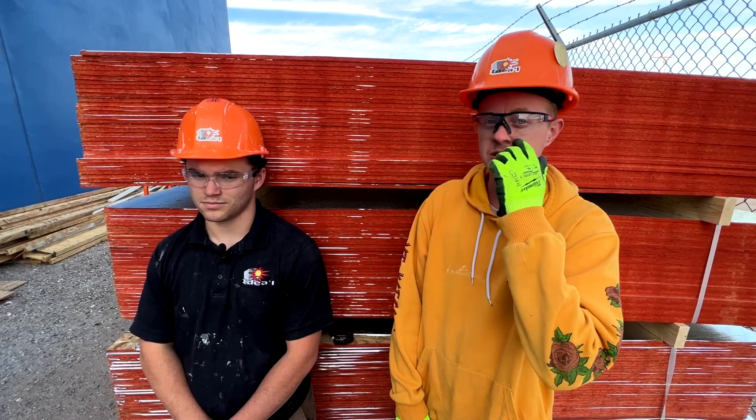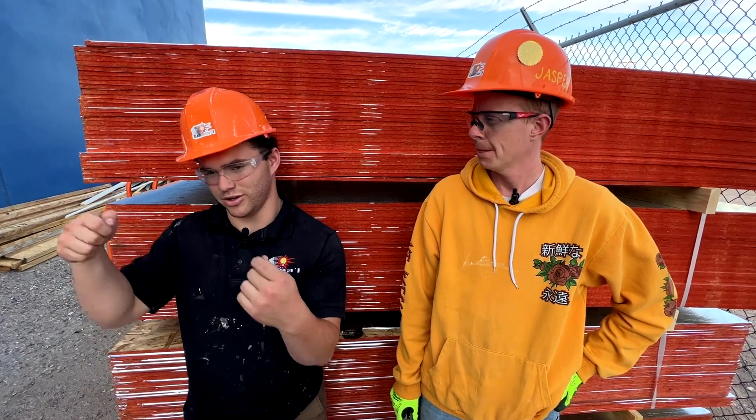One thing I learned from Cory is when you're drilling holes through your 2x4s for your PEX to run through, you can cut at an angle instead of always straight through. It's more natural and puts less stress on your PEX — you can cut up, down, or sideways at whatever angle you need. Also, when putting on the butterfly insulators, you can actually stretch them over the PEX after the fact rather than feeding the pipe through and clipping as you go.